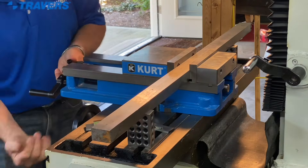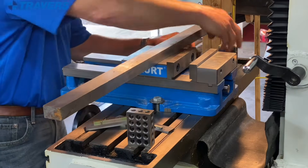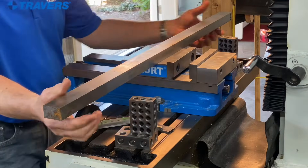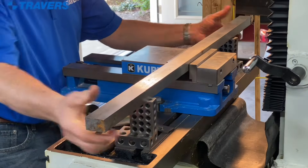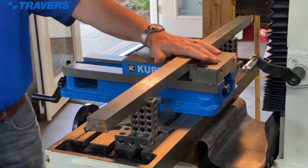And if that's not high enough, as we mentioned, these are all one inch by two inch by three inch. So I know that if I just jack it up with another one, I just raised it by one inch. And now I'm up higher — I can machine on the top and the center.